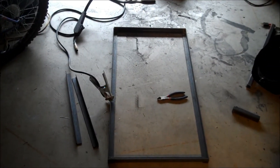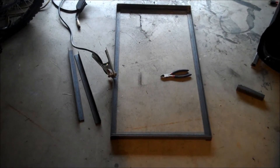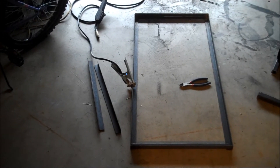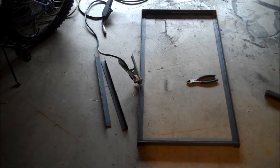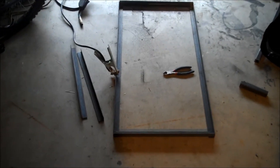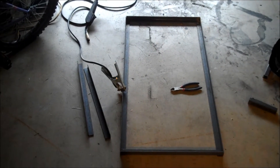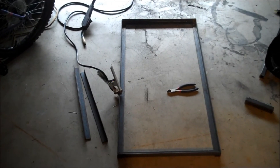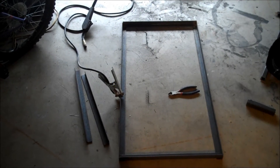Today I've started building my scissor mech base. I've cut the steel to length — it's roughly going to be three feet long by a foot and a half wide. I'm going to put two braces down the middle and then it's going to stand four feet tall. I've just started welding it together and I ran out of weld wire, so I'm going to have to go get some. But here's the base in its rough form — I've got a couple of welds done on it.